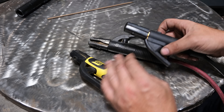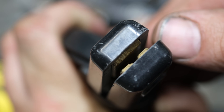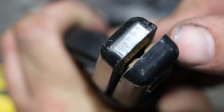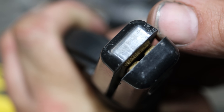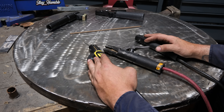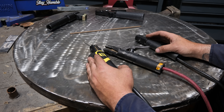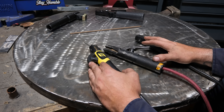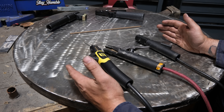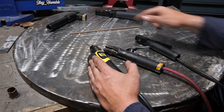The Lincoln style has a flat jaw setup. It works, but when you're talking 1/16 rods and even sometimes 3/32, these don't hold on well after you arc through it a bit. These are in the middle to upper end of conventional stingers, and honestly if you do a lot of stick welding you owe it to yourself to buy one of these. But if you really do a lot of stick welding or have a hard time not sticking the rod, you might want to look at some other options.